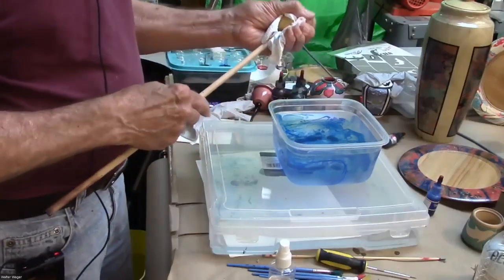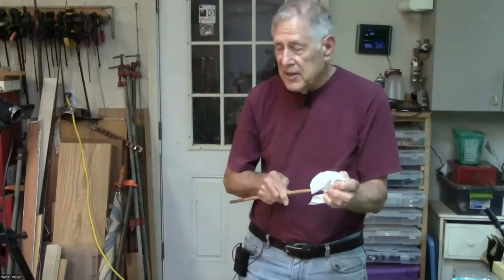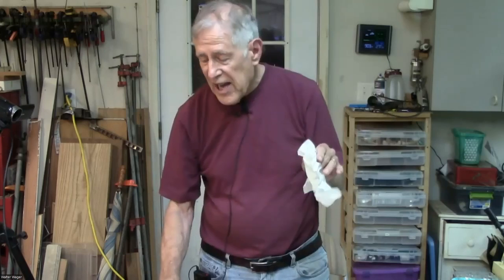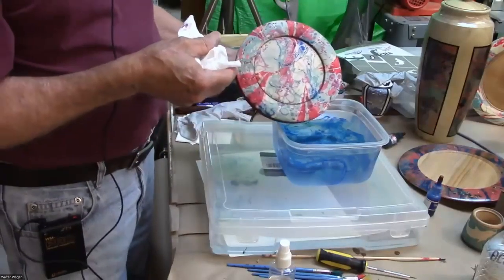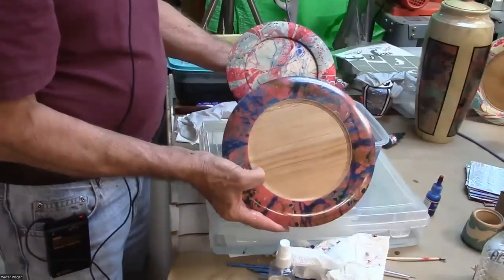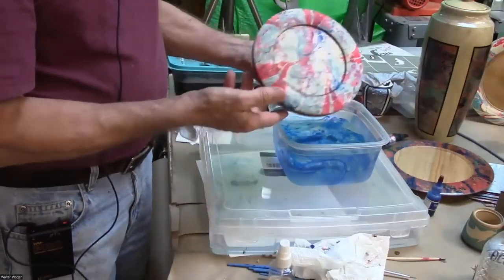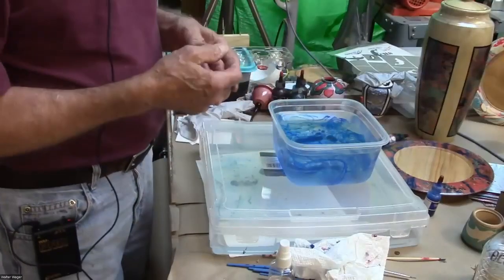Could you strain that paint out through a filter? No — I've tried putting it through a paint strainer and all you do is mix it together a little more. The pigment is so fine it won't strain. When the piece dries it will look dull, but when you put lacquer on it and a finish that reflects light, you're going to pop those colors right out. It's hard to understand how that happens until you do it. The paint is topical — it grabs the top surface of the wood much like a stain, but you can sand it off. It's acrylic paint, and the alum grabs it and embeds it in the fibers, but you can sand or turn it off.